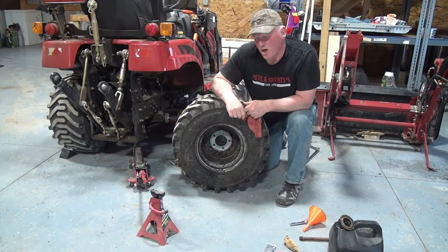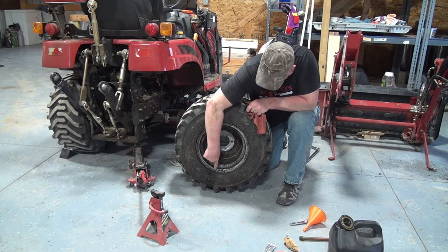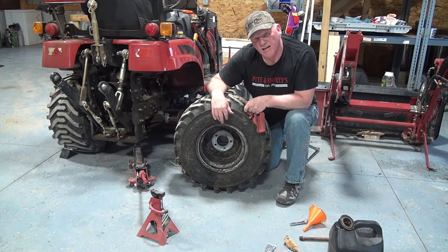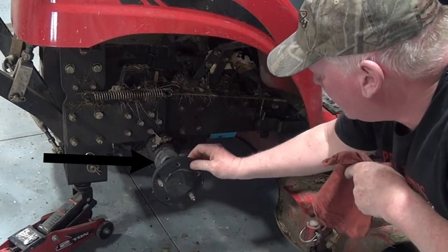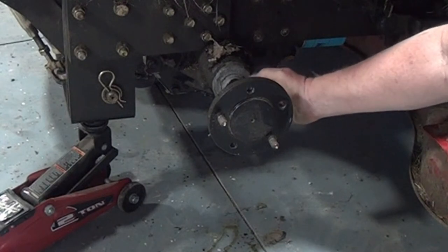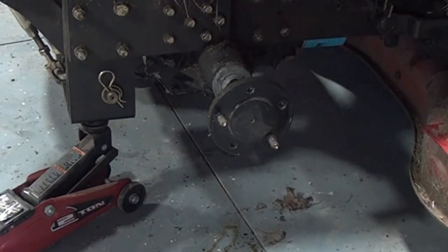The big reason I know I've got a seal problem — other than the obvious fluid leaking on the floor from somewhere under the tractor — is if you look on the inside of your hub and you've got oil leaking out from the inside of your tire rim, it's got to be coming from somewhere, and the only place it could come from around your tire is the seal on the rear axle. Here's what the seal looks like: you've got your axle and your seal. You can see the previous job I did without taking the tire off — just putting gasket material on there. I'll have to remove that. There's also supposed to be a snap ring.